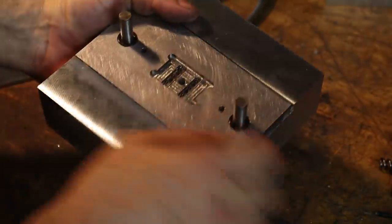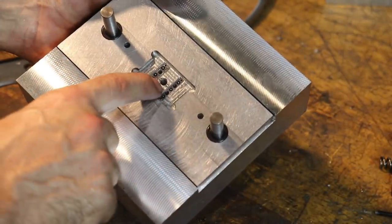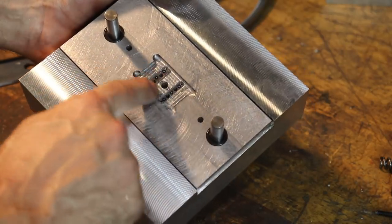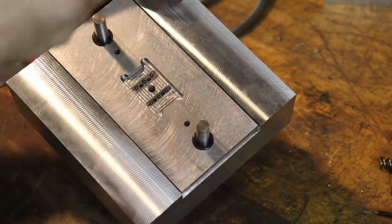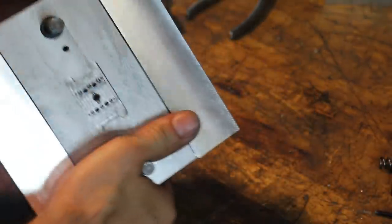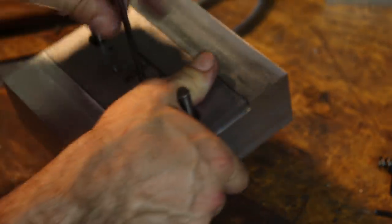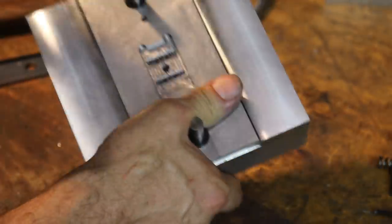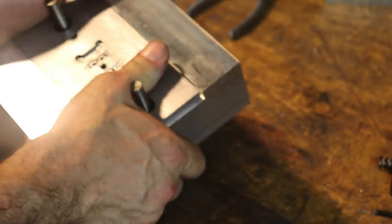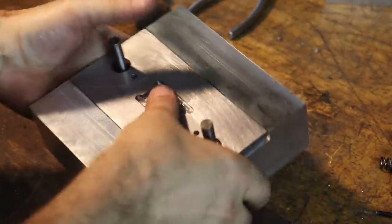If you recall, in the bearing block or the mold core block underneath this stripper plate, there was a tube that was sticking up. Well, there's a corresponding tapered hole in the stripper plate, and those are concentric, and it's kind of a swage lock. And then the ejector pin for the entire system pushes up through all of that, and I'll probably have to chase it with a reamer because I already feel how it's having a little bit of a problem. But yeah, there's an ejector pin that kicks the sprue out of the middle. But yeah, that needs reaming. I'm sure there's a little ledge in there I've got to fix.